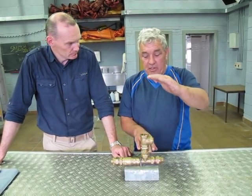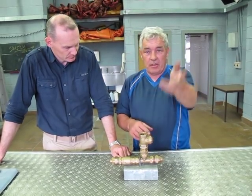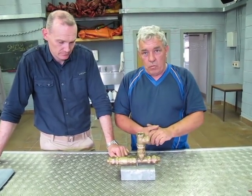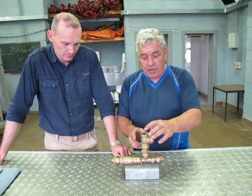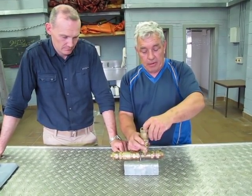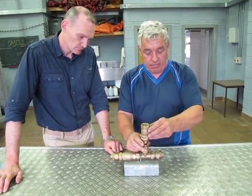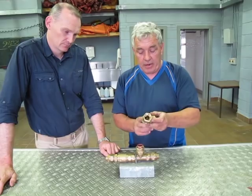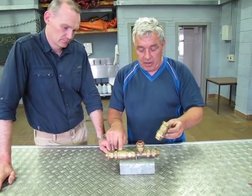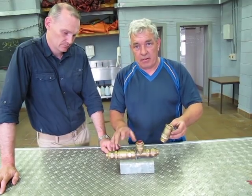It can also be submerged up to 12 inches. You can extend this outlet 12 inches to come out over the top of the water. Maintenance basically involves these flap valves, which are very cheap to buy. You have to keep them clean. The spring non-return valve sometimes gets a bit of dirt — just disconnect it, clean it, and that's it.